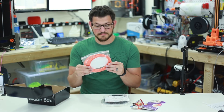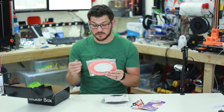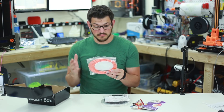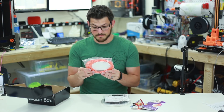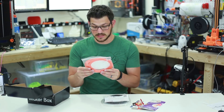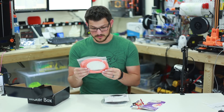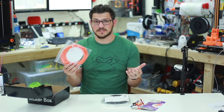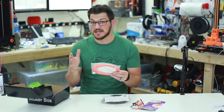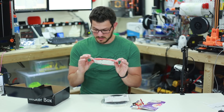Next up we have a PC Plus PBT by Push Plastic in this very awesome looking orange. The settings: hot end temperature 235-250°C, bed temperature 100-125°C — so hot stuff — speed 30-60mm per second, non-abrasive. Here's the info: a blend of polycarbonate and polybutylene terephthalate, which makes for a great balance between stiffness and ductility. I'm not an English major, those words get a little bit complicated. I'll have to go on their website and look it up. But either way, it looks cool. It's hot temperature, so I'm thinking PETG slash ABS style — I mean, it's polycarbonate, so it's up there in temperatures. But either way, we'll see how it turns out.